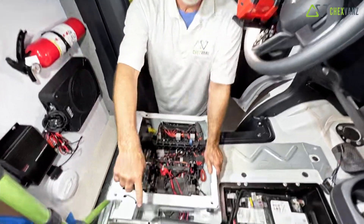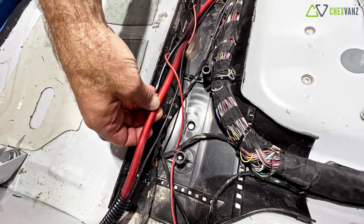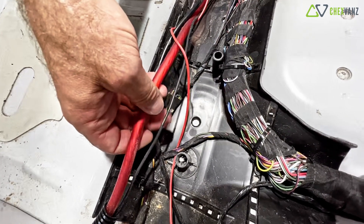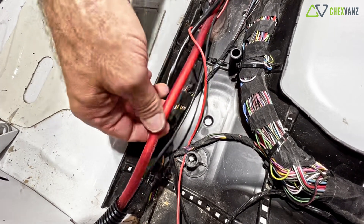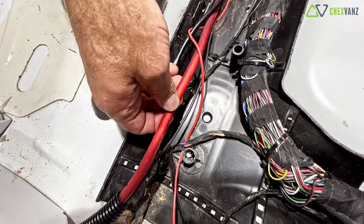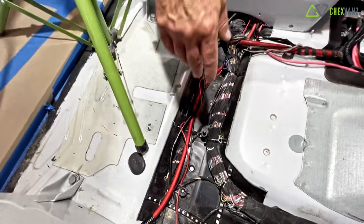Let's start with this positive run. There are two wires that run from our alternator charger: an 18-gauge and a 4-gauge wire. This 4-gauge wire will go to a positive connection over near our starter battery bank. The 18-gauge wire is being used as a remote turn-on/turn-off of the charger. So when you start your engine, a signal will get sent through this black 18-gauge cable that will tell your alternator charger — the Renogy — to turn on. The positive is one part of two cables that will actually provide power to your charger, and the positive is being done from the starter battery.